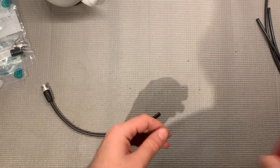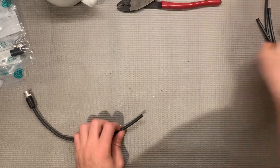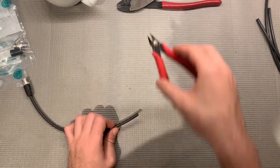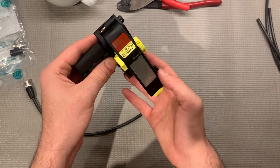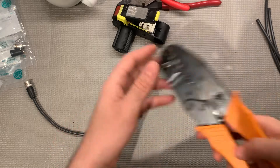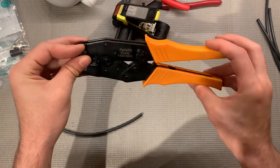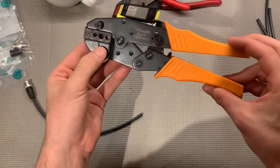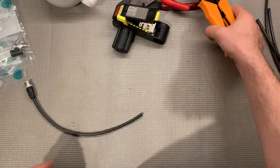I have this big wire cutter that I use for actually cutting the BNC — it's not the right tool, but it works. And then I have a little flush cutter for just cleaning up any edges. This is the most expensive part: it's a TS-100U stripper. I'll put all the links in the comments so you can buy the stuff if you want. This is a Paladin crimper, got this on eBay for about $20 used. When you buy one, just make sure you have the right die for the size cable and connector you're using.